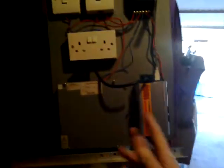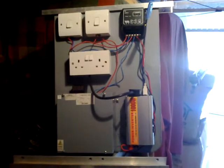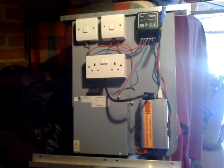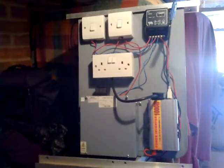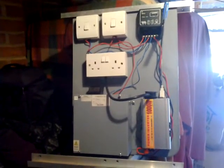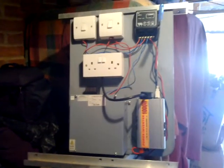It's not screwed to the house because I normally just use it portable. It's only a 10 watt panel, so it's not going to charge up an insane battery bank in a few hours — it's just to keep the battery topped up so if we ever need it, it's ready. If I was going to run this permanently, I'd probably want like a 40 watt panel minimum; a couple of hundred watts would be great. But for what I need — just to run the lights, maybe a laptop, charge my phone for a couple of hours — that's fine.